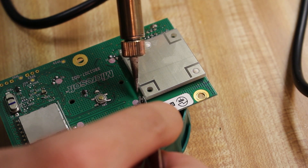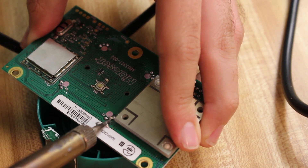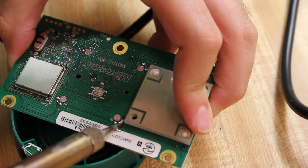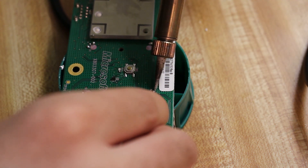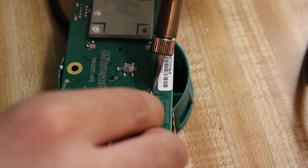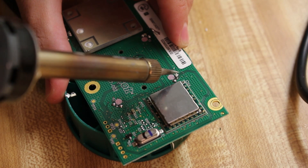Now what we want to do for the other four quadrants is we want to put in these LEDs crooked. I understand this is going to look like you're doing it wrong because these LEDs are much smaller than the ones we just pulled off, but trust me it will work. You want to take the positive portion of the LED and solder it to the positive pad, which in the triangle formation is on the left. The little tiny middle pad is the negative pad, and that's what we want to solder the other side to on each one. If you feel like you put any of them in improperly, feel free to go in and correct it. If you put these in the wrong way, nothing's going to happen to your system - the LED itself just will not turn on.